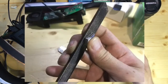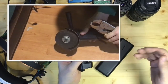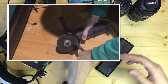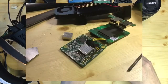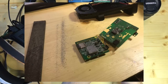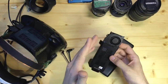So I ended up having to shave off pretty much half of the heatsink from one side. You can do it either by filing, sanding, or using an angle grinder at your own risk. I used two heatsinks for more thermal mass — one on top, one on bottom — so there would be more material to sink the heat into and more surface area to blow it off from.